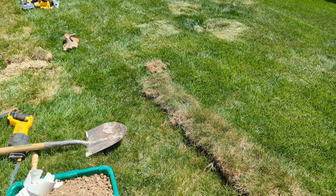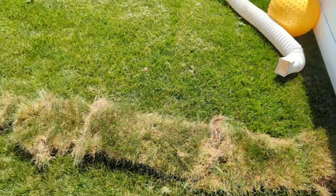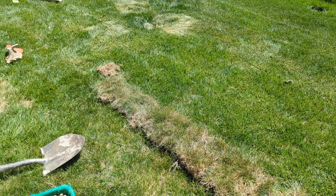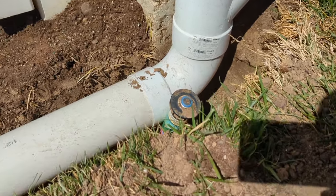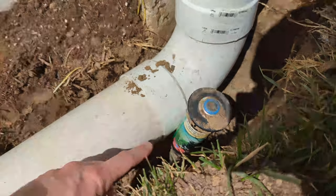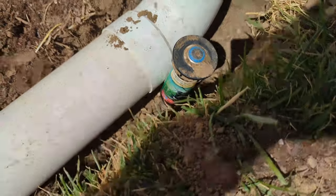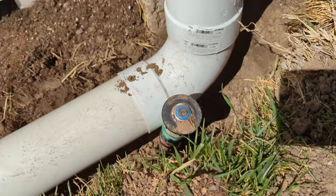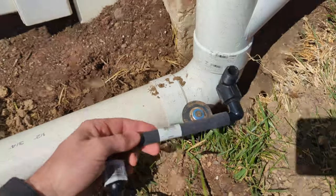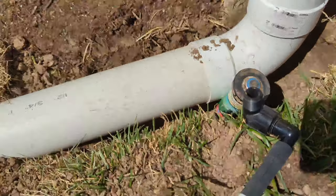During the digging process, I also cut a layer of sod off here that will go back on top. Once it's done, I'll level it off, throw that on the pipe with some grass seed around it, and it'll look just like a yard again. And since no job can ever just be straightforward, this sprinkler head is in direct conflict with the downspout — it was buried straight right down here, directly underneath. So I'm going to relocate it using a coupler that screws onto the riser and then this little flexi hose contraption that will move it over a few inches and up, then backfill the dirt.